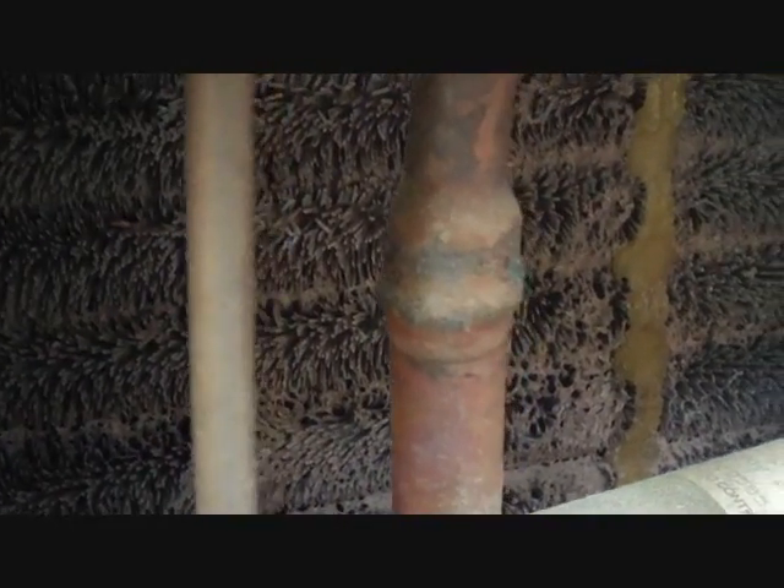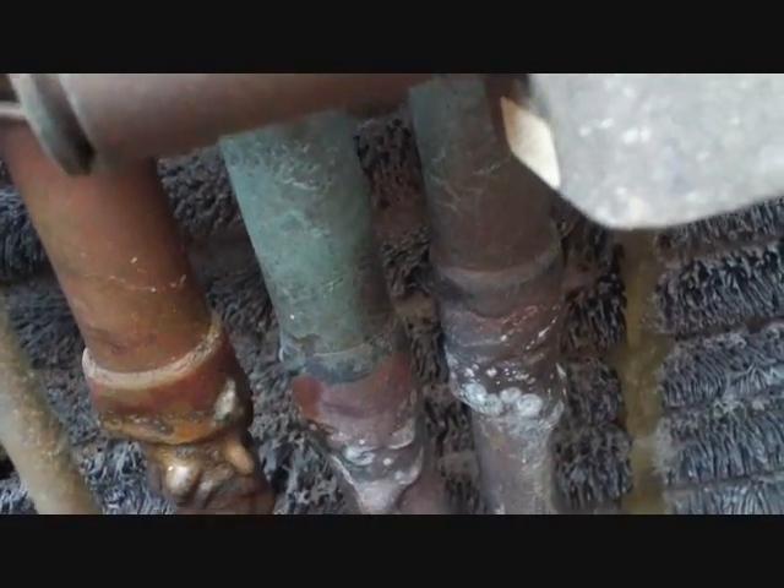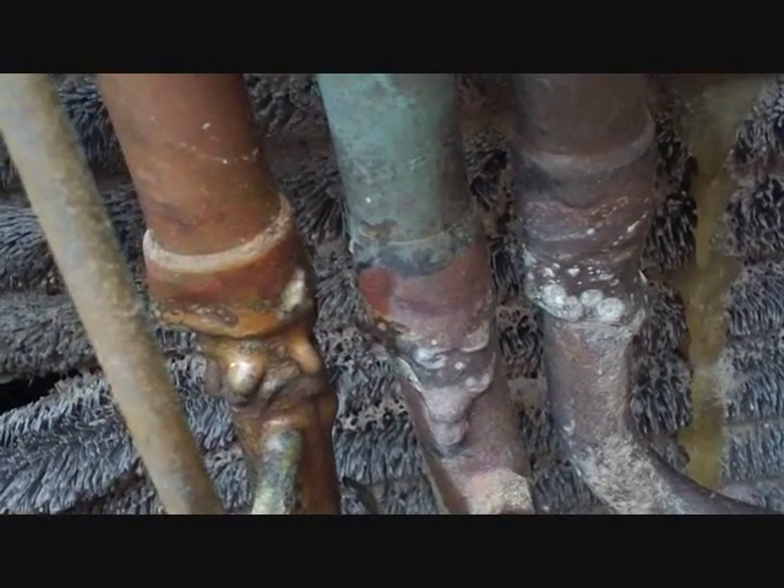The top looks better because it's easy to reach. So I've got to try to re-weld this — there's a leak right over here, it's gonna be a mess. Here's our TXV — it's bad, we've got to change it out. It's brazed in, so we'll probably have to sweat it out. Not really enough room to go chopping up pipes and splicing things together in here. The equalizing tube — we'll see if we can sweat that out too, because it's a pain to try to put them together. We're always concerned about the tube collapsing and defeating the purpose of the repair.